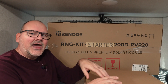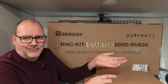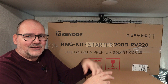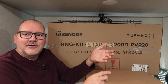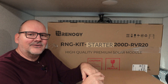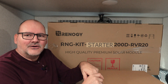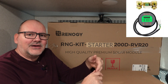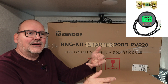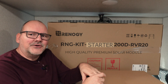You don't get Bluetooth connectivity, and at first I thought I needed it because I have a Renogy 40 amp on this RV that has Bluetooth. When I first used it I was like, this is really nice, it's like a necessity. But as I've been using it more and more, I discovered I don't need it. It's nice to see how much solar power you're getting in, but you don't really need it if you have a shunt. I got a quark shunt — it's very cheap — and it tells me how much solar is coming in, how much power I'm creating, and how much I'm using off the system. So I found that I don't really use the Bluetooth app.